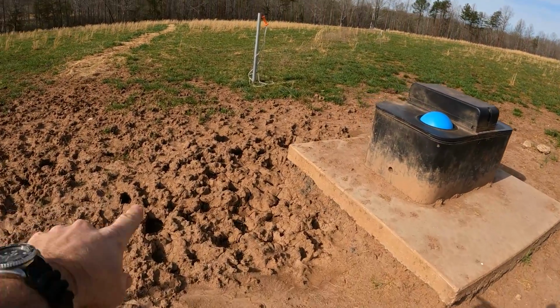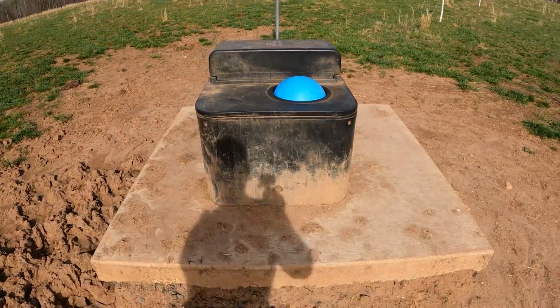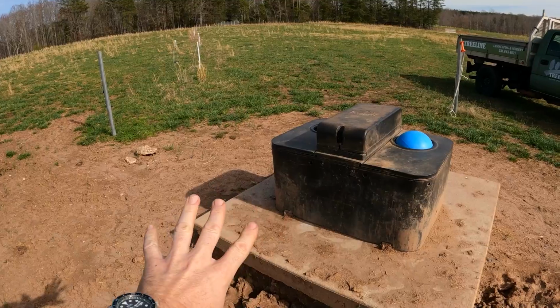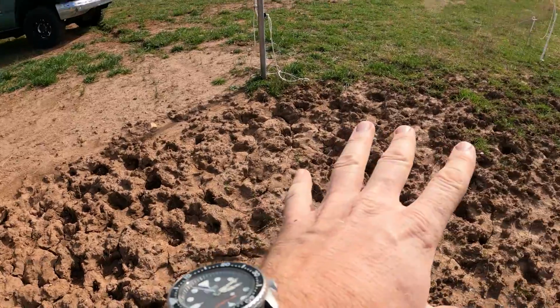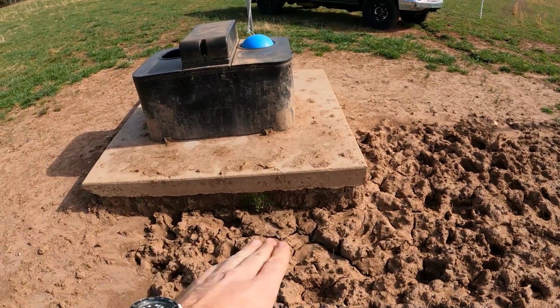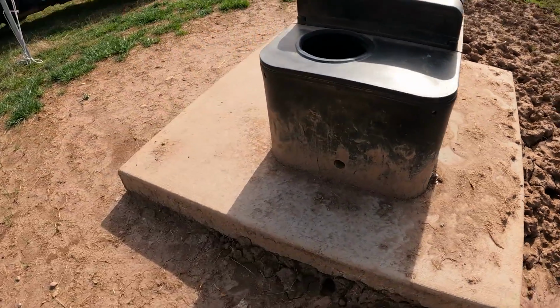This is the problem at our water tanks, okay? So this is a Mirafount 3390 2-ball water tank. It'll service up to 150 beef cows. It is a frost-free, freeze-proof system. But you can see we poured our concrete on grade, and the cows are really trampling the land up right here. So we've got to build it up with gravel, with rock. So that's the goal. This is 4,000 PSI concrete.